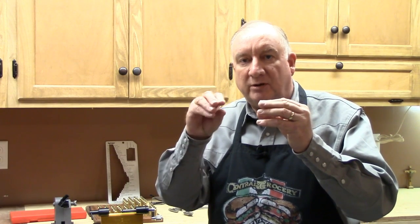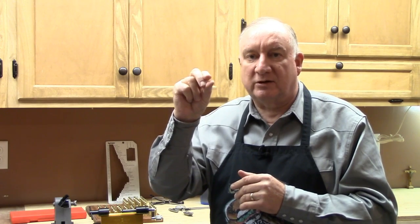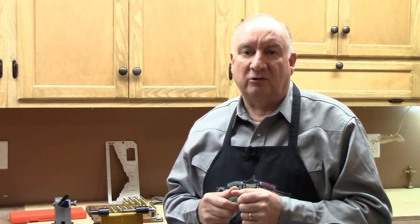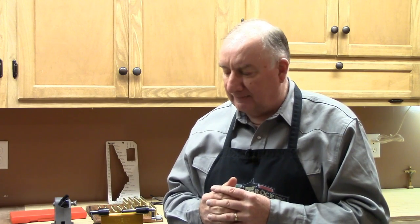I'm not going to discuss that, but what that involves is simply the recognition that a particular chamber dimension with regard to the bullet dimension has a neck wall thickness which will accommodate a certain release dimension. Everything is mathematically calculated. You start with your bullet diameter, 0.224, you add your case wall thickness on one side, which is so much, and then you have to have a 1/1000th or a 1/1000th and a half or a 1/2 of a 1,000th or whatever clearance that the shooter deems as necessary for his rifle. He sets it up that way, and that's how he orders his case sizing bushings, his neck sizing bushings, and that's how he orders his chamber. And everything is conforming to that, knowing that bullet dimensions have a particular standard. So that's what occurs in that particular game.